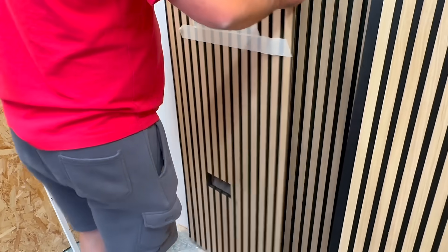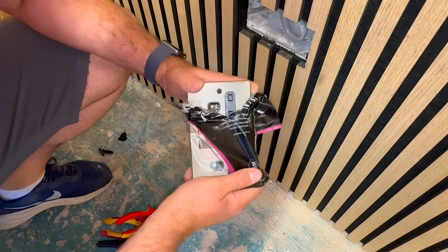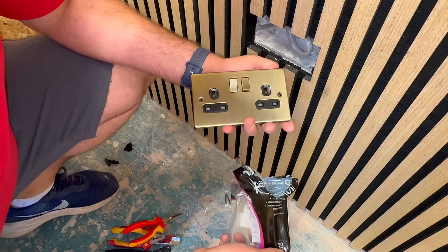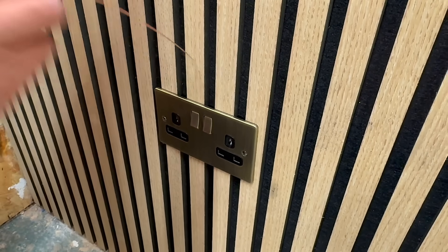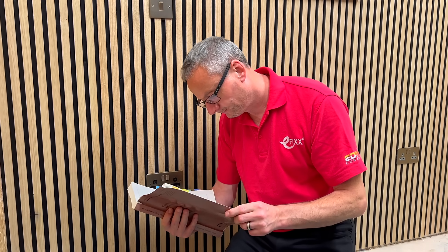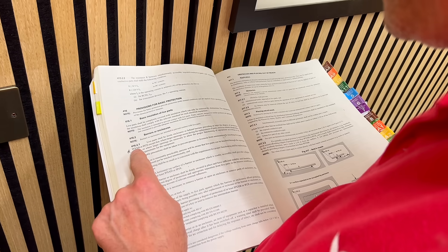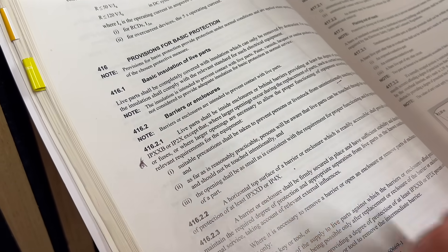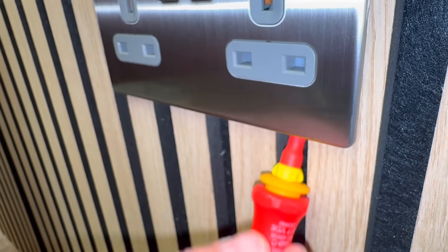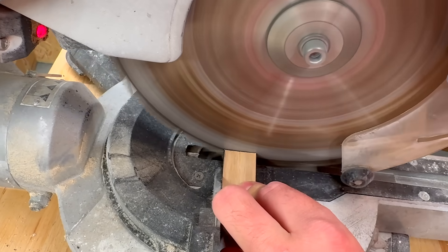However, in doing this there's a hidden risk that many installers miss, especially when you're retrofitting to an existing wall. If you simply bring the socket forward and fix it to the existing back box using longer screws, the gaps between the slats create open areas where fingers can reach through and come into contact with exposed electrical terminals. That's a serious safety issue and a clear breach of BS 7671. To comply, the top surface of any enclosure must meet IP 4x, and the other sides, bottom and front, IP 2x — in other words, the design must prevent fingers or objects from accessing live terminals. So if you're pushing accessories forward to match the face of the slats, you need to deal with those open voids, because without protection it's not just untidy — it's unsafe.